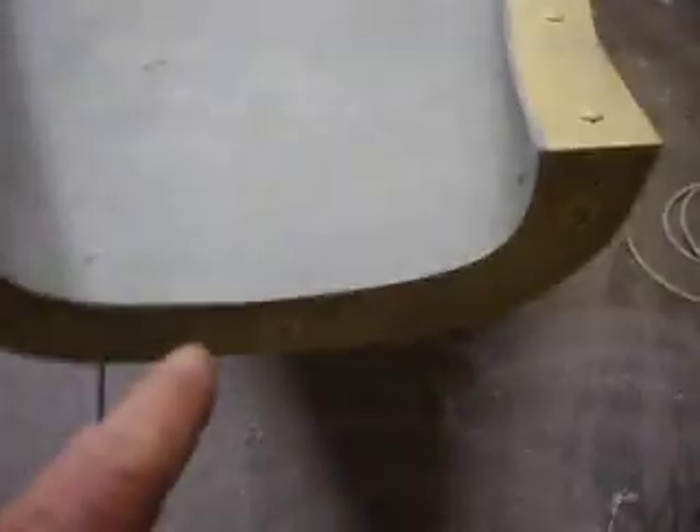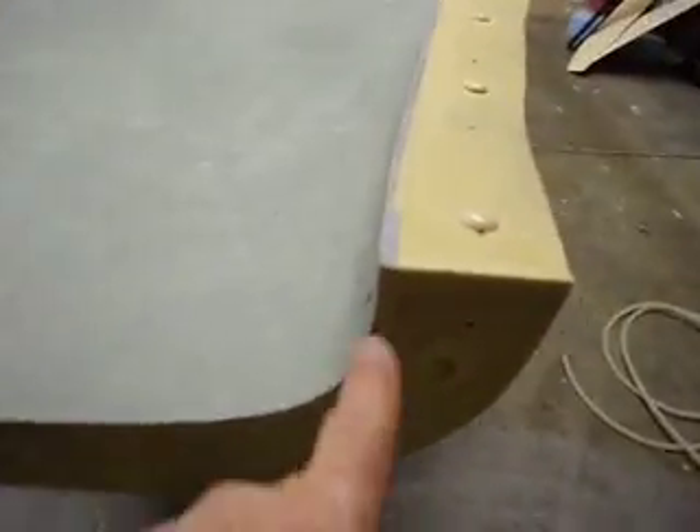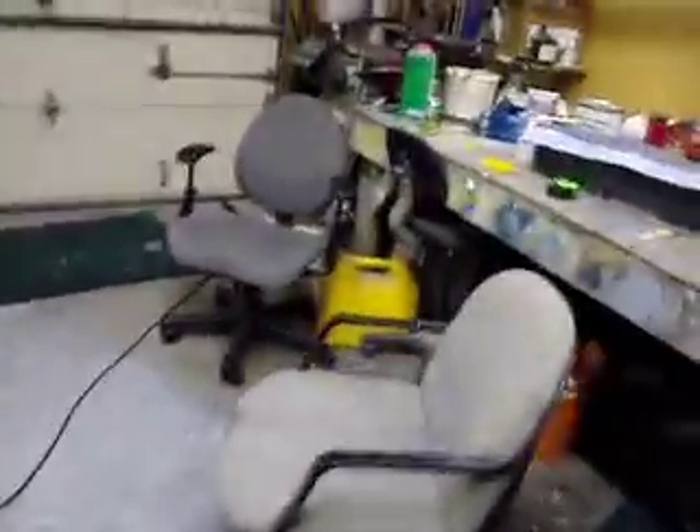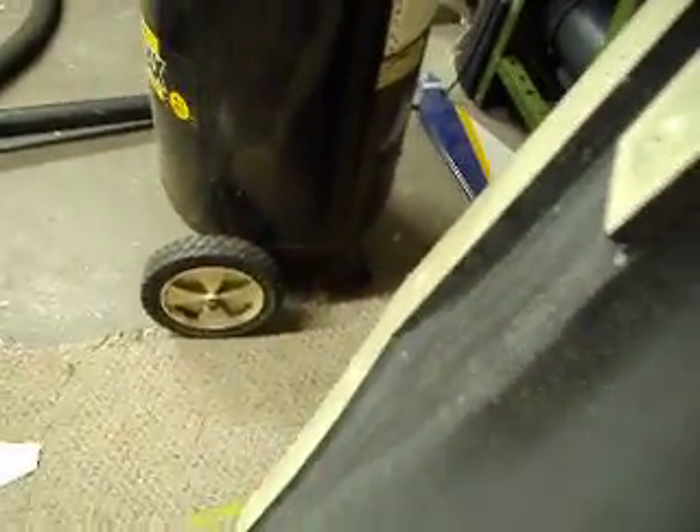In the morning we're going to put this wood on this edge and glue the top on. I know y'all are wondering how we're going to do this. Remember back when I did my nose piece — I got that all laid up, those two pieces ready to glue together — I put flanges on the ends. I'm going to put two flanges down there, one there and one here. I'll put my center on first, then I'll be able to take my one-inch fiberglass tape and reach right in here and do that seam. Then I'll put my bulkhead in that piece and be able to go through the bottom and tape that seam.